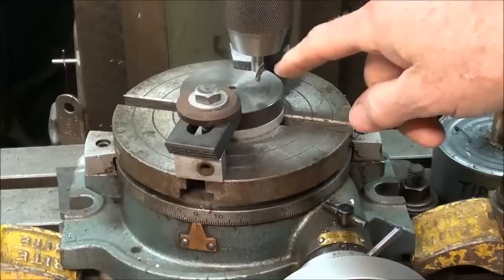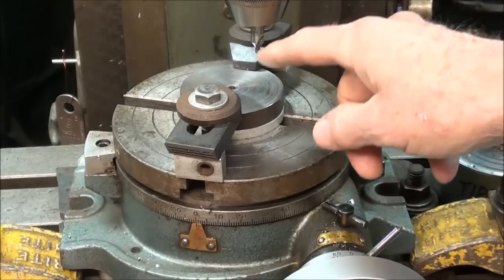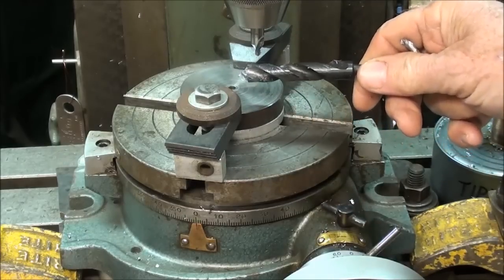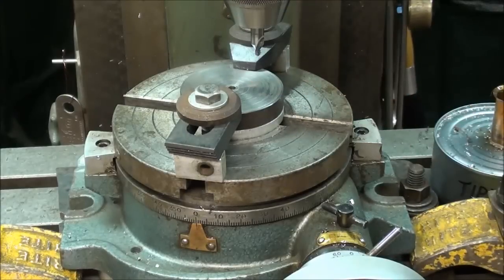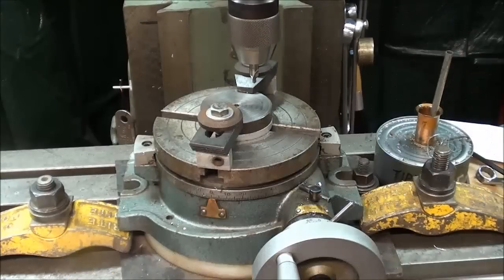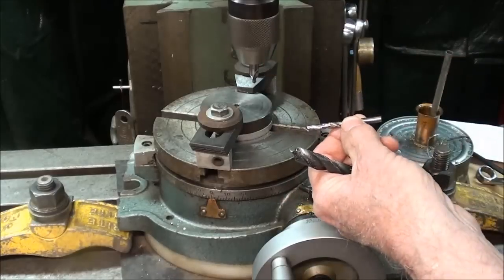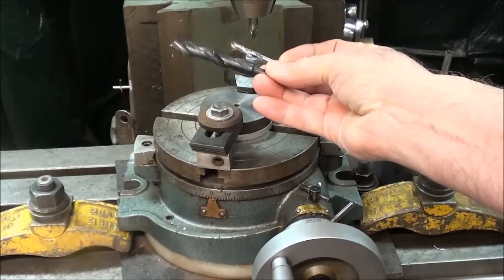What I'm going to do is center drill all six holes, then come back and drill all six the pilot size — 3/16ths — and then come back and drill the final size, which is 7/16ths. So actually I'm going to drill eighteen holes total. You also have the choice of changing tooling at each position: center drill, then pilot drill, then finish size, then rotate the table. You can do it either way, but this time I'm going to center drill all six of them. I'm a big fan of stubby drill bits — extra short drill bits. With those you don't have to worry about spacing like you will with long jobber-length bits, so get yourself sets of stubby bits.